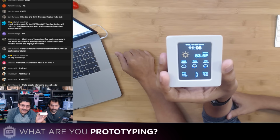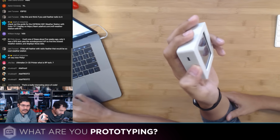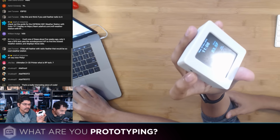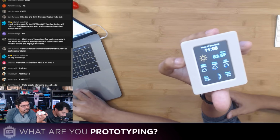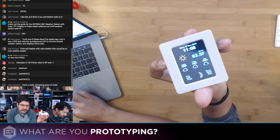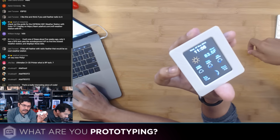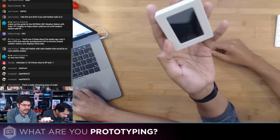So there you go. One thing I did is I added a slide switch in the back over here, so I broke it out. I wired some wires to the slide switch, and then cut apart some male jumper cables so that I can easily plug them in and out of the female header pins on the back of the screen. There it goes. Turns off. I think I have it set to 10 seconds.